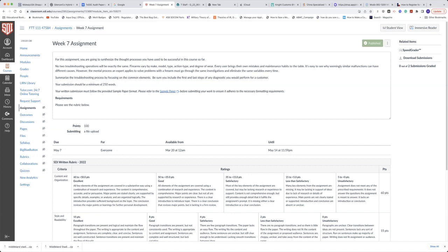Would open flame be ill advised due to contamination? I wouldn't use the open flame because you're going to deposit soot. And you don't want to use MAP gas or brazing torches because it'll get too hot. So electric or toaster oven. For most of the paint-on finishes, the baking temperature isn't very high, 230 degrees for an hour, up to about 350, if it requires baking at all. But 200 degrees for about 15-20 minutes, you should be good on that.